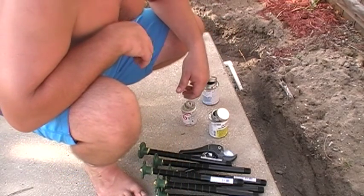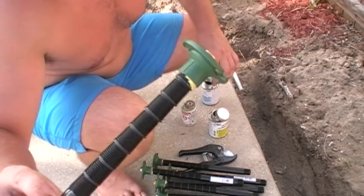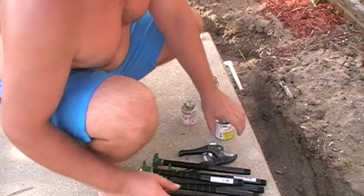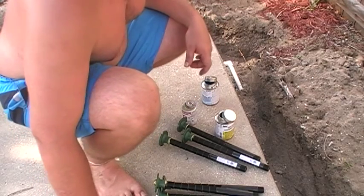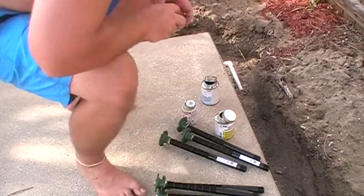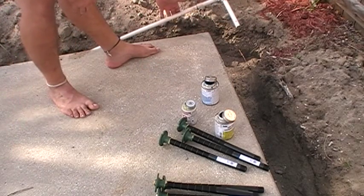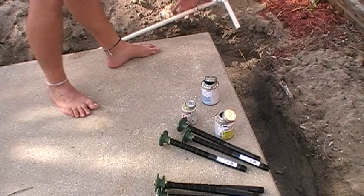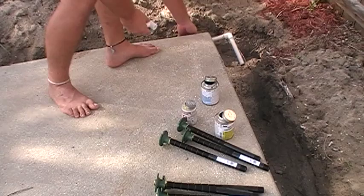Welcome back to TrueJack — how to fix a Florida sprinkler system. What I've done is prepped all these fittings. What I'm gonna do is cut this little pipe down here where you see this 90, cut it right about here, put this T in, and then get a 90 around the corner.